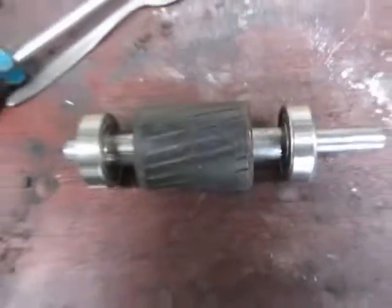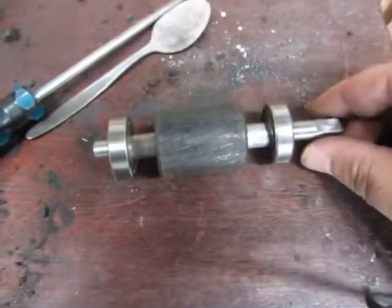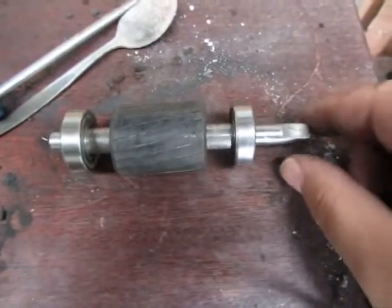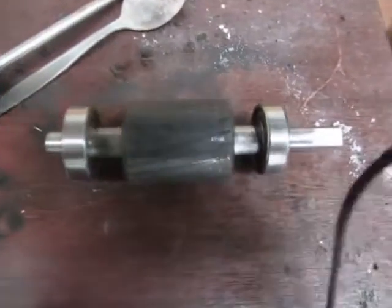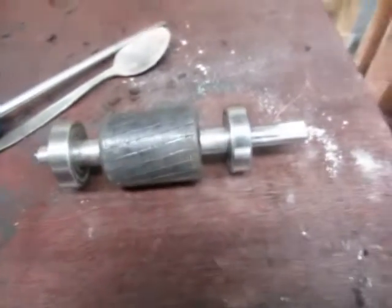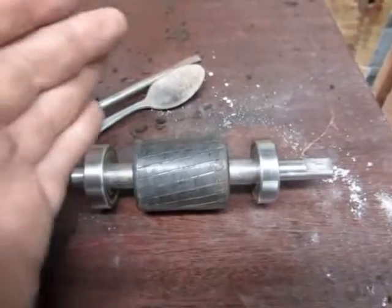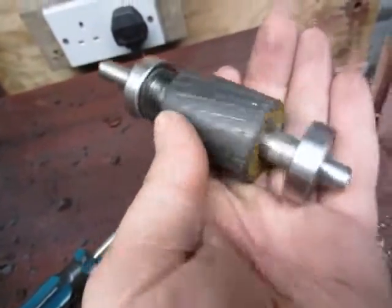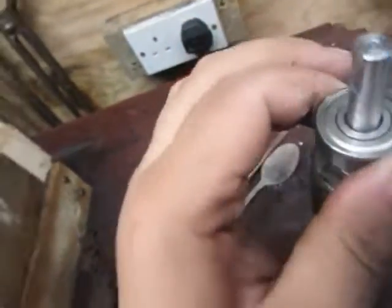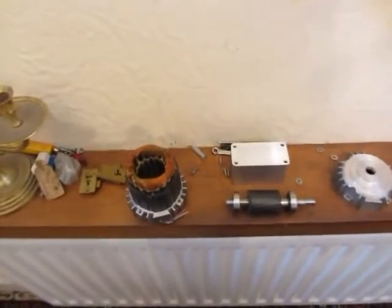I can take it off the press now — that's done. That's what it looks like. Let's put it on the table here. That's the shaft of an induction motor. You can see it's got a flat on it for the drive end, and the opposite end is just the back end that spins around inside the stator, as shown in my last videos. The motor end shields which I've been casting go on either side to make it into a motor.